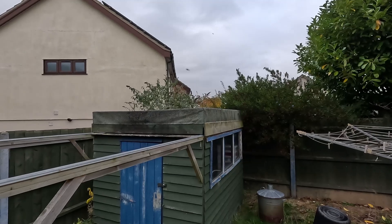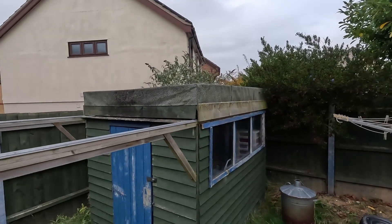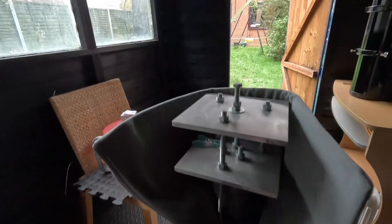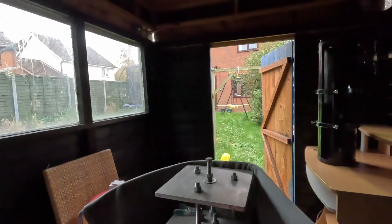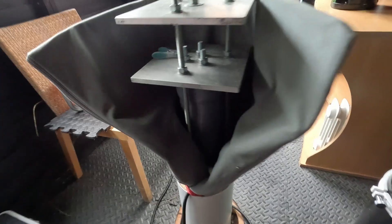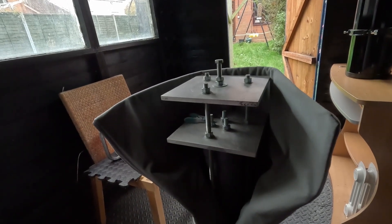First, I'm going to point out two mistakes I made — partly because I did it on the cheap. The first mistake: I just used any tube I could immediately find to build my pier. It's really narrow — about five inches. I did put an oversleeve on it and fill it with concrete to make it wider, but I'd say an eight or nine inch pipe is about the minimum to make sure it's strong enough and eliminates vibrations. Don't cut corners.